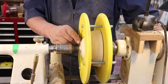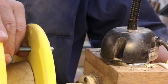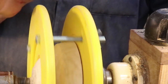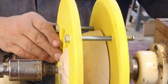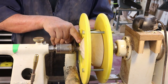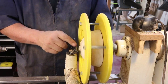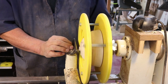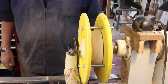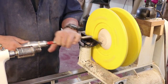I've taken the time to put in a little bowl that I've been working on. I've taken the longer bolts and replaced them with four-inch bolts, otherwise they're going to hit your lathe back there. I've brought my tail center up to line this up. All I have to do is spend a little time right here and take that little nub off, and then I can do some sanding — I can reach that whole area in there with hand sandpaper or my drill. This shouldn't take more than just a second.